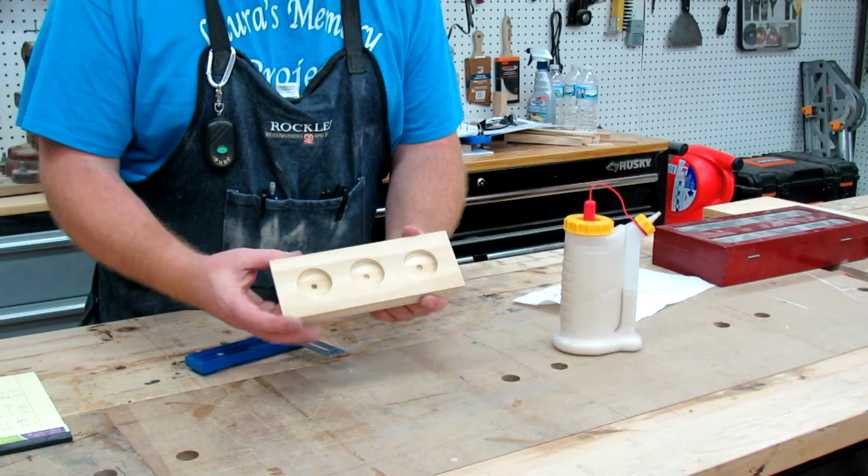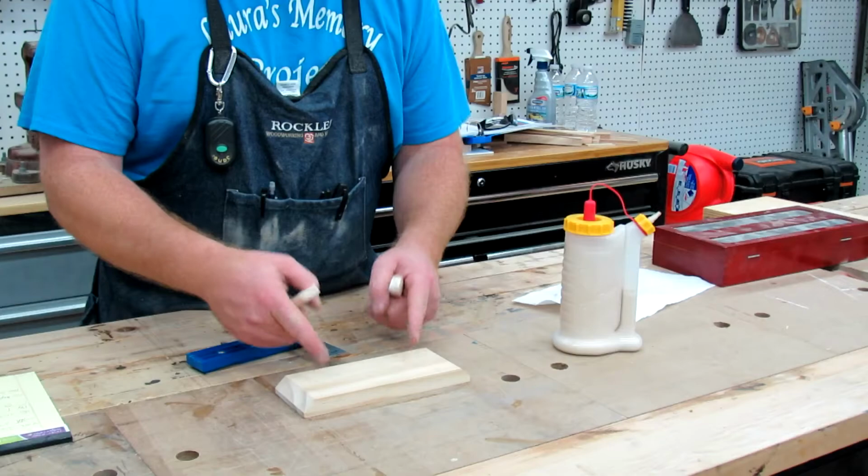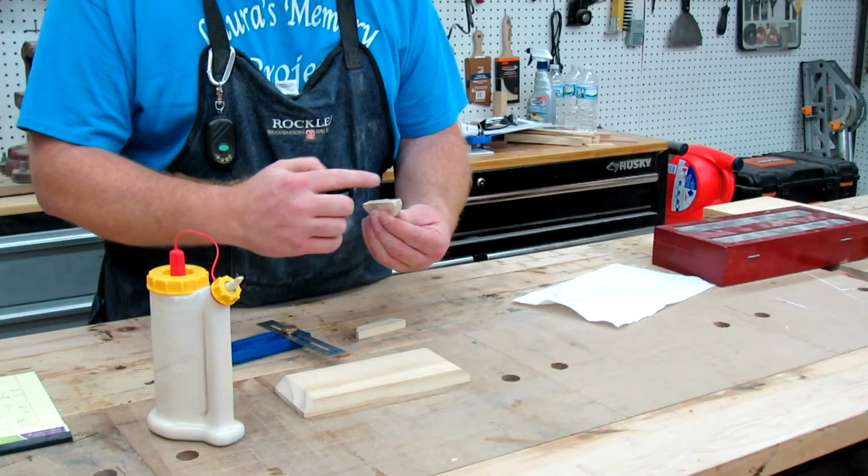you want to go ahead and sand it, and then you're going to mark from the very ends, not the 45 ends, but the very edges, inch and a half in, strike some light lines, and then what we're going to do is we're going to take our glue bottle, go ahead and put a little bit of glue on here. You don't need a ton, because you don't want a lot of run out,